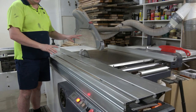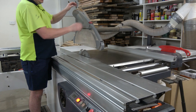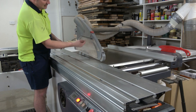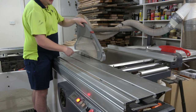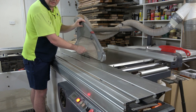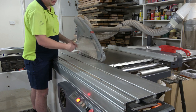One thing I really like about sliding panel saws in general is that they have overhead guards that are not attached to the riving knife. On this one in particular, it goes up and down so I can set it to the height of my material. It captures a lot of dust that comes up the back of the saw blade, routing it through a dust port to dust extraction. It also serves as a physical protection — even though it's pretty flimsy on about a 1.4-metre arm and can hit the side of the blade, as you can see from the score marks. But I prefer it to eat a bit of plastic than a little bit of flesh, and it serves as a physical boundary to keep me from going too close.